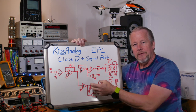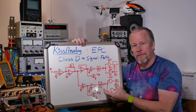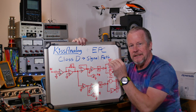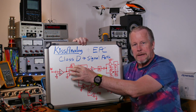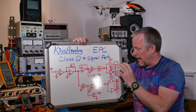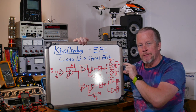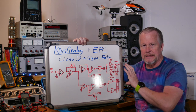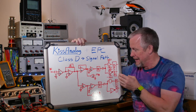Some of these amplifiers not only provide isolation but also provide a function like gain. The input has a capacitor to block off the DC and only let the AC signal through, so you don't have to worry about DC current going to your speaker. The output stage ends up at a bridge stage with a driver driving two GaN FETs. The outputs of those two FETs come over and you put your speaker between them — that's why it's a bridge. I showed that in the last video.